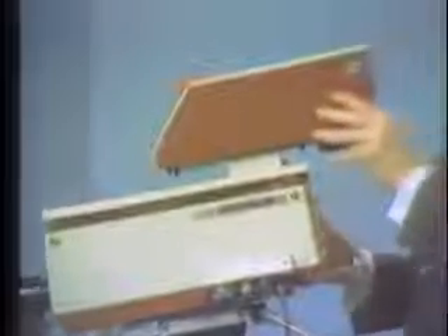The viewfinder tilts and serves two functions: not only as an indicator of what the picture material is for the camera operator, but it also eliminates the requirement for expensive waveform monitors, in that we've incorporated a waveform sample into this viewfinder. In addition to doing a waveform sample for regular video levels, it also sets up color levels by nulling for white balance.